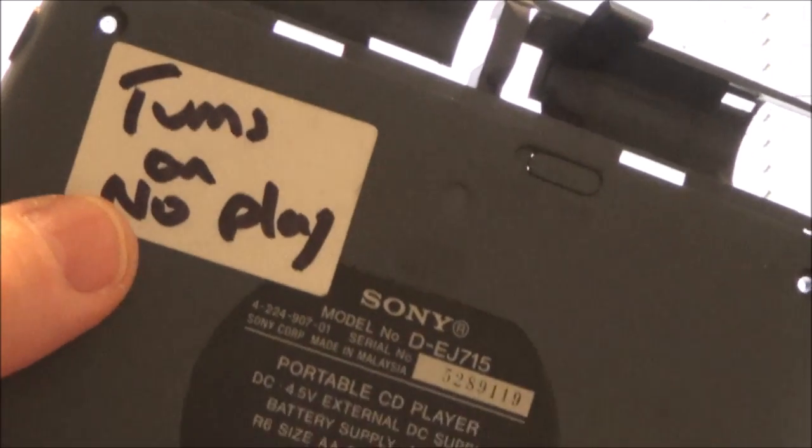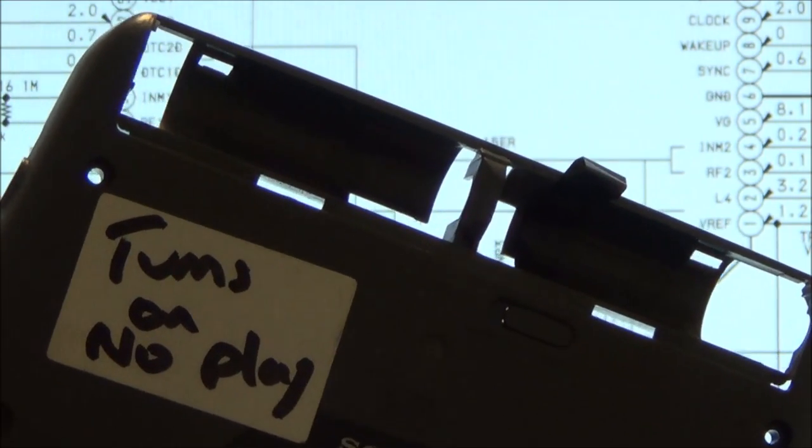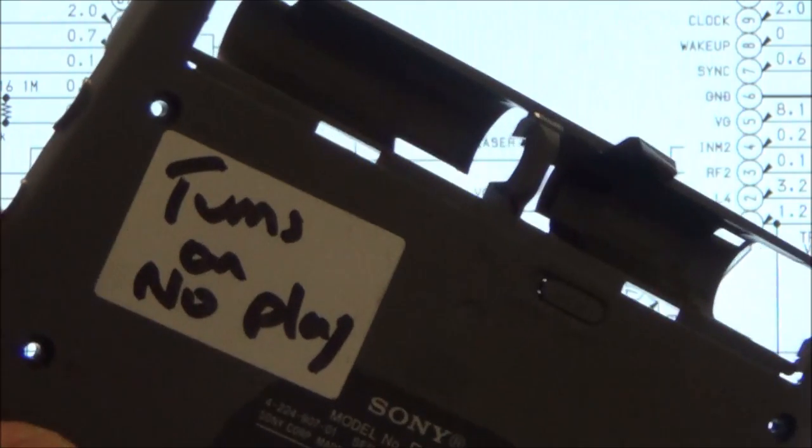I think now what might have happened here is the laser may have burnt out and then batteries have been left in it because it hasn't been working, and then the damage that I fixed today is purely secondary because the batteries have been left in. I'm wondering if the original problem is that the diodes, the laser itself, has burnt out.